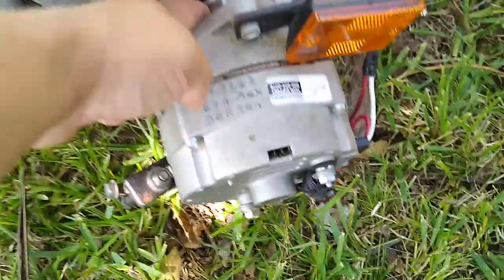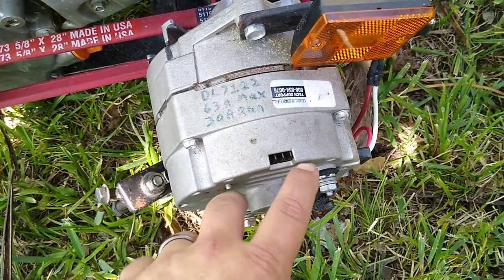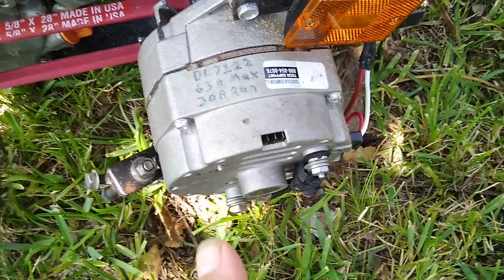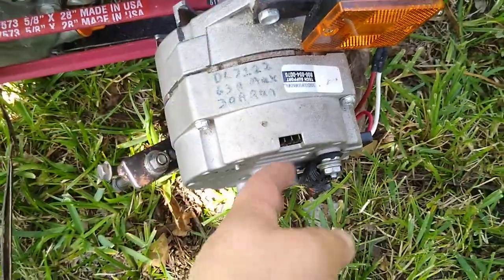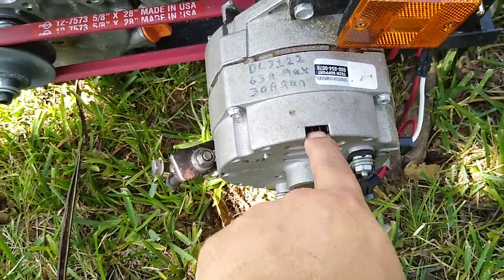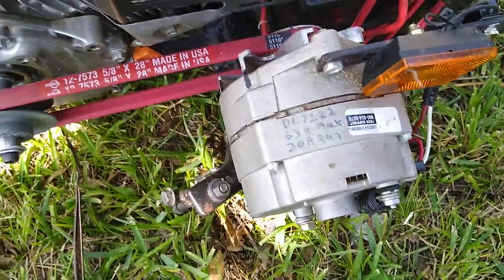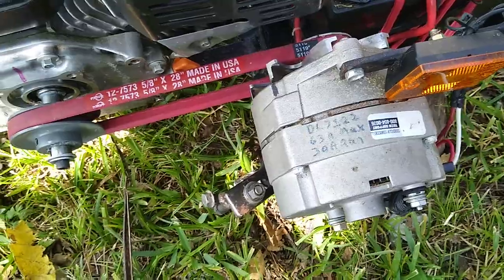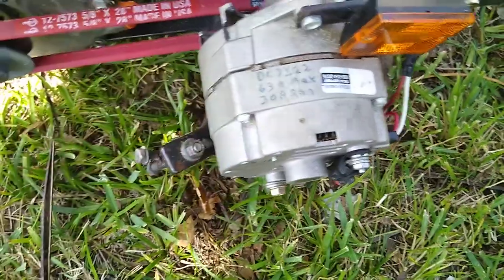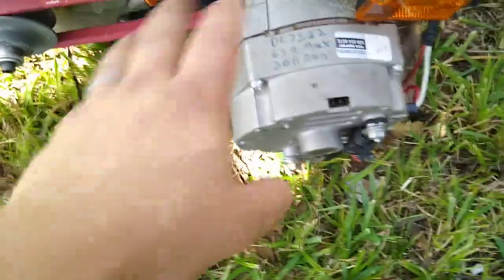Because when you're pulling it from the front, the air is going to get hot as it goes through the alternator, so you're going to be blowing hot air through here. The best way is to pull the coolest air from outside in here and through there, where you're bringing cool air in, cooling the regulator, the rectifier, everything in here. You're cooling that first, and then adding some cooling to the coils and everything. They can technically take a higher temperature than this device will be able to. So the engine spins going counterclockwise. So it will mess you up.